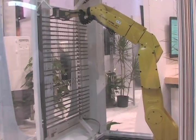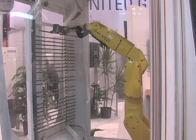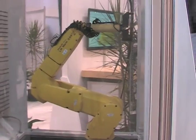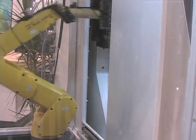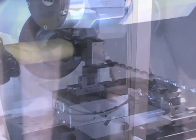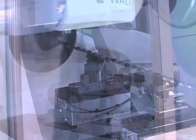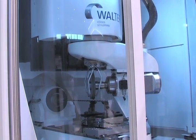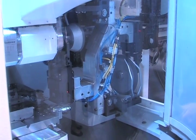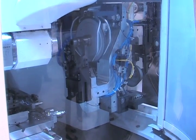I start the machine. The first thing, the robot will take the tool. We are using the two traveling steady rests to hold the tool in the tool holder. First, we are doing the end face of the drill — primary and secondary. The next operation will be fluting, using a wheel with 10 inches in diameter.